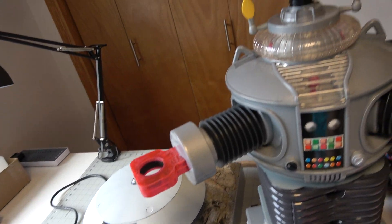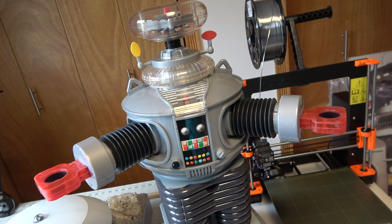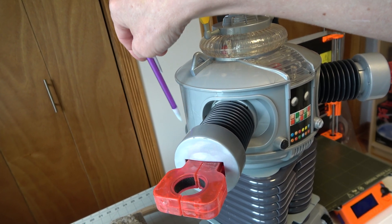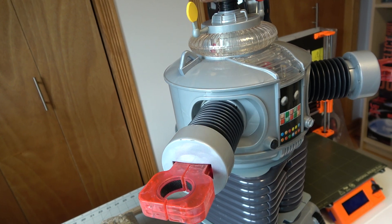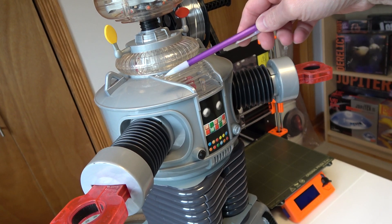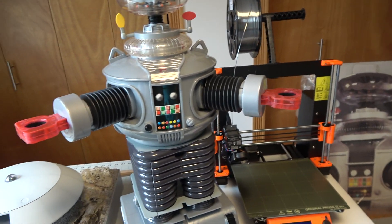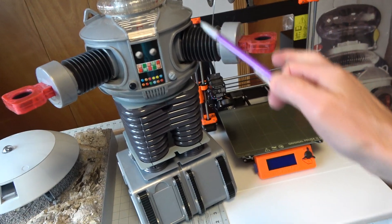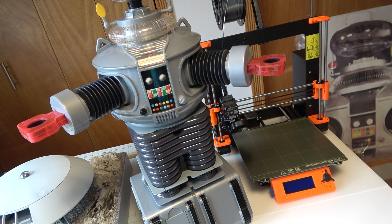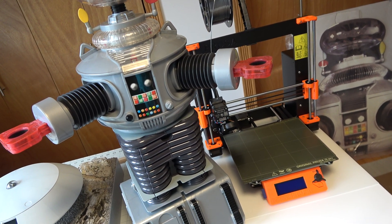What's nice about EasyRobot and Arduino is they're pretty easy to program scripts based on something that happens in the robot. For instance, on the power pack, it'll be either a ground connection or a lost ground. When the board sees that signal, it'll trigger a series of events like powering everything down and triggering a voice clip. I belong to the B9 Robot Builders Club — a co-op where members each individually make different pieces and parts.